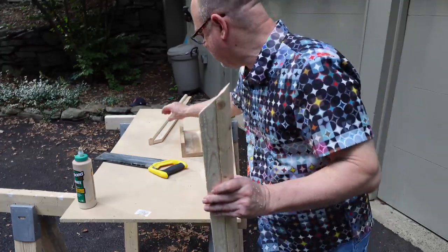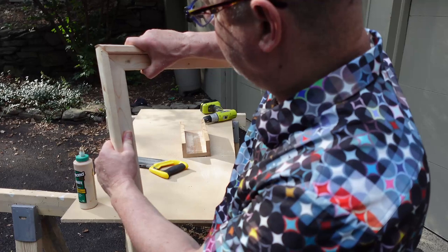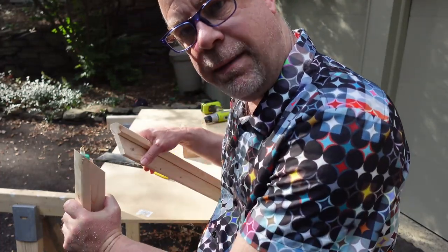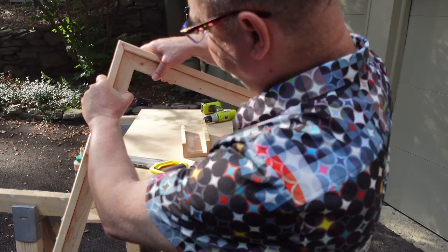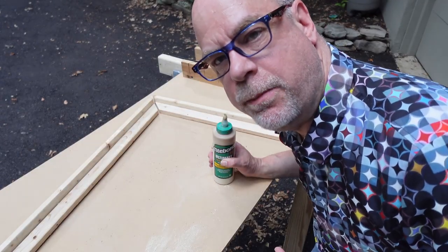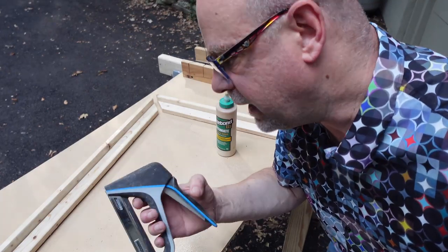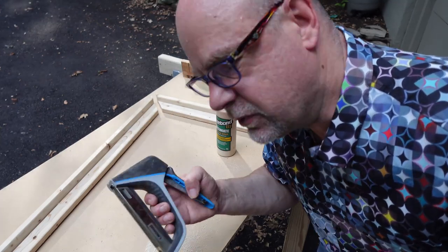We've been able to pull together the different pieces that we need — I have two of them here for this demo. These two pieces, because they're both cut at a 45-degree angle, should meet together pretty well. If it's not exactly perfect, we don't really care because a lot of this is going to be hidden under our canvas. This is really just a frame we're going to use to stretch the canvas on at the end of the day. 45 degrees meeting together will create a nice 90-degree corner. Now that we have everything cut, we want to put the pieces together. We're going to put these corners together using our Titebond wood glue, and we're also going to hold them in place using some staples from a staple gun. I want to make sure the staples are fairly long — I'm working with three-eighths-inch wood staples in this instance.